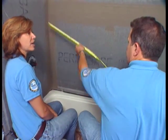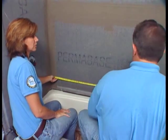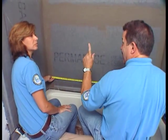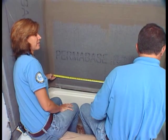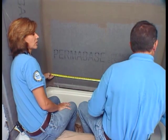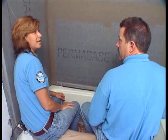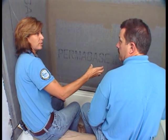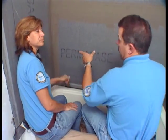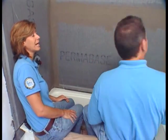We're using six-inch tiles, so we just want to make sure on this back wall that we don't have a tiny little sliver on one side — this allows us to cut one wall instead of both. We've got a full tile plus almost three-quarters of another one. 58 inches divided by six is nine plus three-fourths of another tile, so we would put the cut tile down in the corner — especially since when people come through the door, this is the first thing they're going to see.